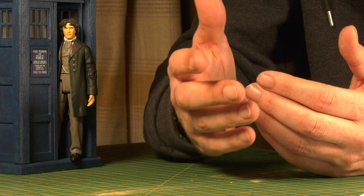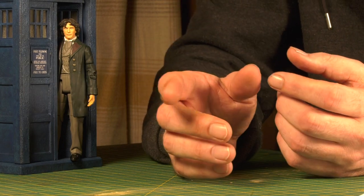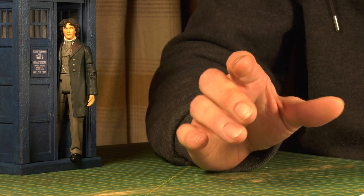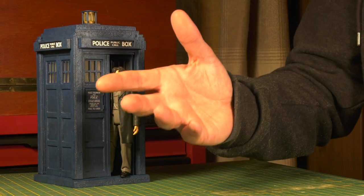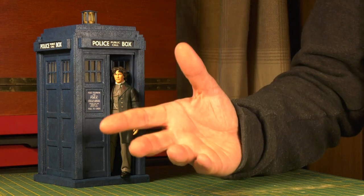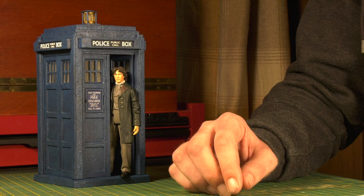The second issue has my attention, and it's all to do with the material's longevity, given that it is a biodegradable product. It does break down over time, especially with prolonged exposure to sunlight. Also, heat plays in on this too, so it does make me question, how will this impact your work in the long term? So maybe PLA is better for making tooling masters that you can take moulds from and pour up casts. At least that way you know you're not going to risk losing your work as time passes.